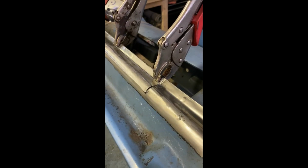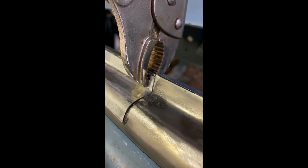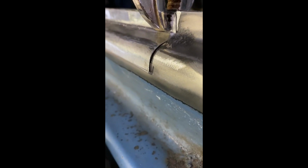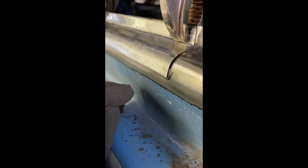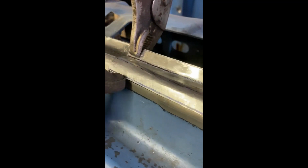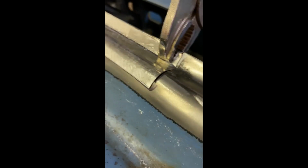So I forgot to show you, I cut the piece out and behind. As you can see, we're fitting fairly flush there. The vice grips are holding it up against the back flange, and I left some material in this bottom side along here. If you look from this side, you can see it's not sitting flush with the top surface like it is up here, but not down here. That's because of a technique that I saw online, from a guy named Fritz or something. So I tack it along the top here, and then I take the grinding disc and I cut it. That way I have a perfect gap all along there, and then it'll pop right into the profile of the truck. You'll see in a minute.